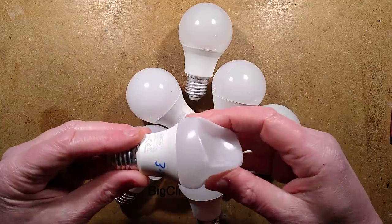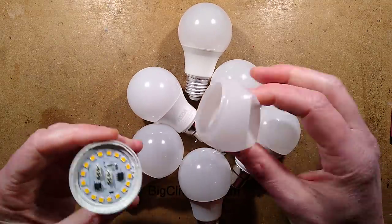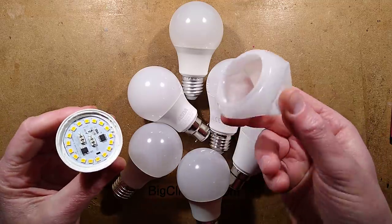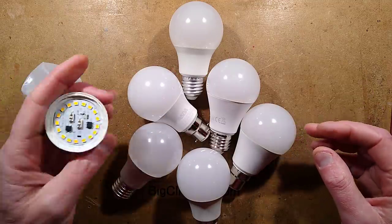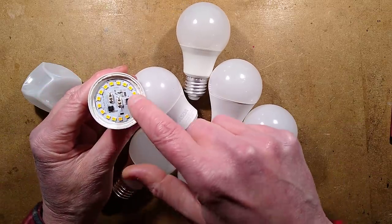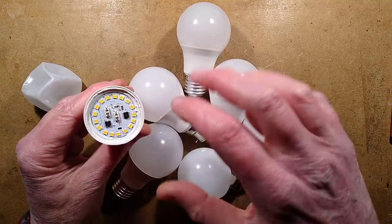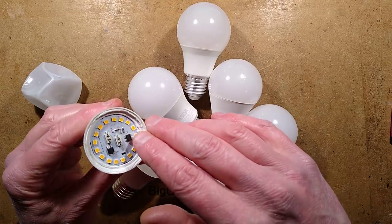When I used the lamp later in another video, people were interested in the fact it was shaped like that. So I thought I'd make a video showing not just how to crush the covers of these lamps, but how to actually hack and modify them, because a lot of these lamps are using a common circuit - linear current regulators - and they're very easy to modify into lower power lamps.